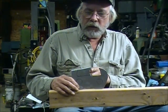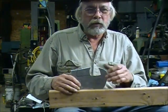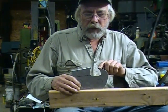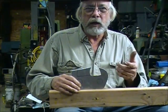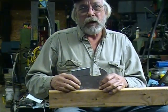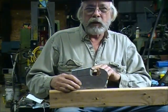You don't need these great big hooks in the cutter. If you think about it, from the tip of this to right here — that's all the deeper it's going into the wood. What is all this groove down here doing anybody any good? It's not doing nothing. That little bit right at the top — possibly up to 40 thousandths when you get way down here toward the end — that's the only part that's cutting any wood.